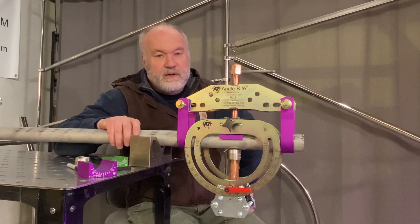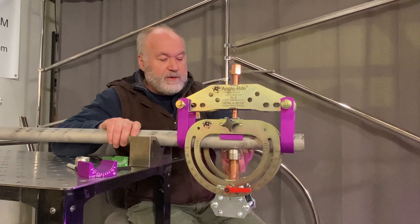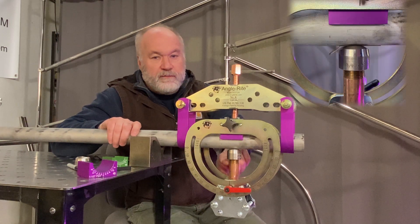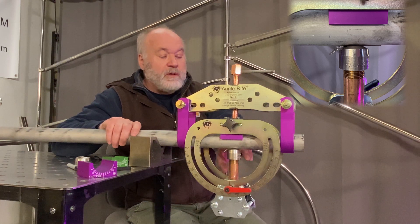This pipe here is an inch and a half schedule 40 stainless pipe and we've got a three-quarter inch threadolette down here. It's screwed onto a red brass pipe nipple. The red brass is used to prevent the galling that you might have happen if you use stainless here instead for the setup. So we recommend dissimilar metal here from stainless when you're tack welding this threadolette on.